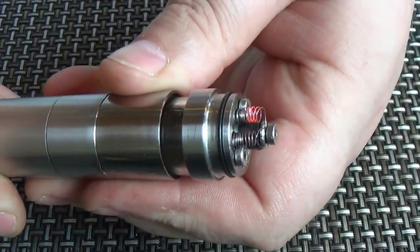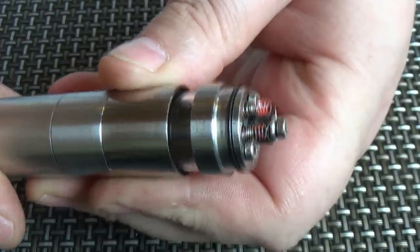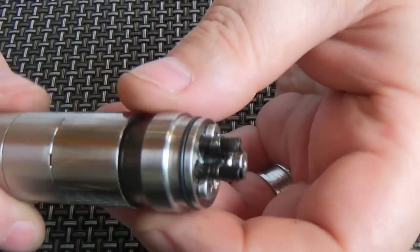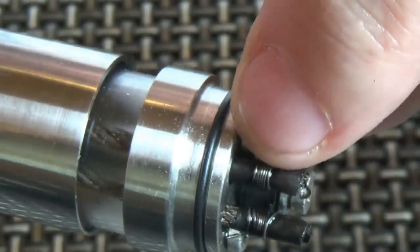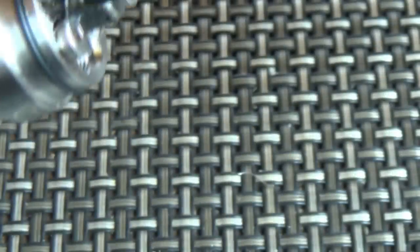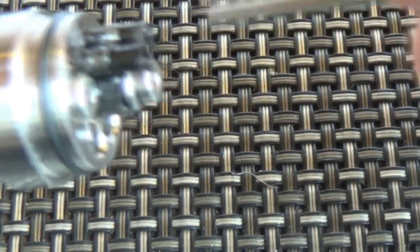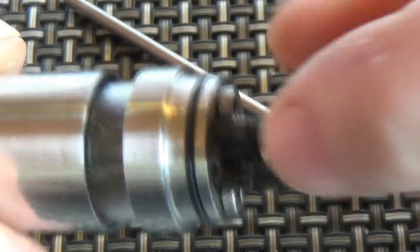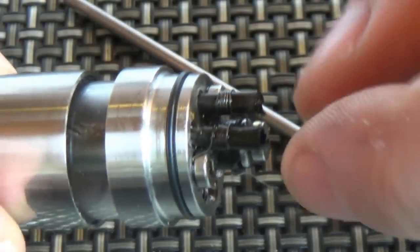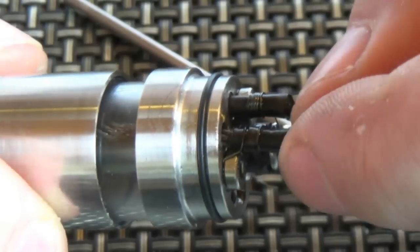Hopefully you can see when I push the button — they're not heating up evenly. So I'm going to try compressing them and going for the micro-coil look. I've got these two little micro-ish coils and a drill bit the same diameter as the hole. I made my coil on this first and then connected them up, pulsed them, tightened them up as you would any other micro coil, and then I was able to just screw my stainless steel rope wick straight through. By using the stainless steel mesh boots at the top, that creates the kind of tight contact there.